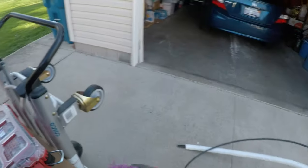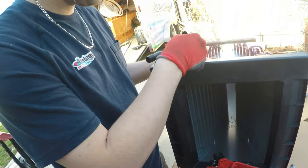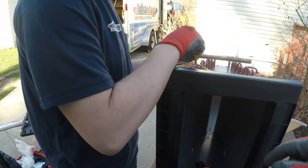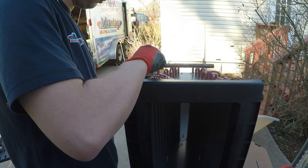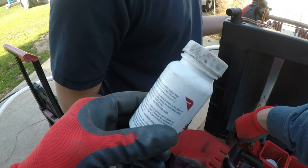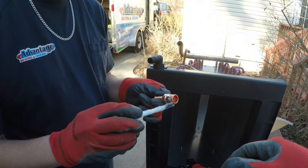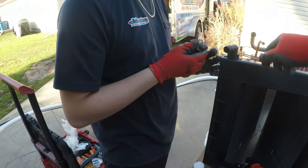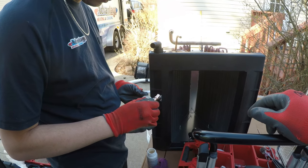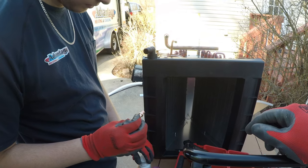Take your three-eighths brush and clean that out. Take that and clean your three-quarter out. Then you're gonna take your paste - I thought we wouldn't need it because those are brand new, but yeah. Take your paste and put a nice coating around that. Make sure you get all of it - stick that in there. Do the same thing to the three-eighths one. If you see any boogers or pieces of horse hair, make sure you pull them off - that'll cause it not to stick.